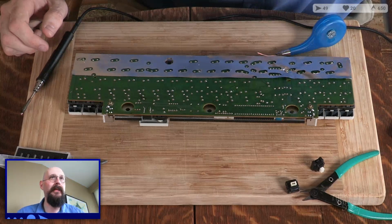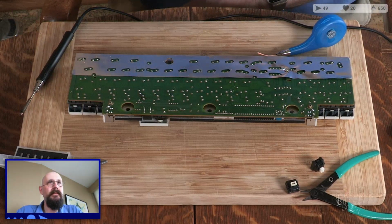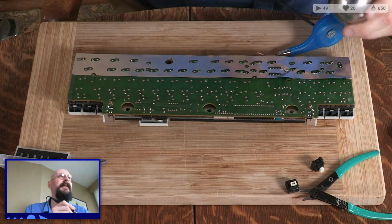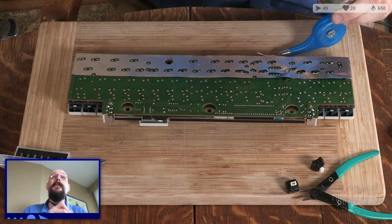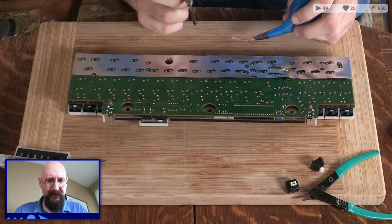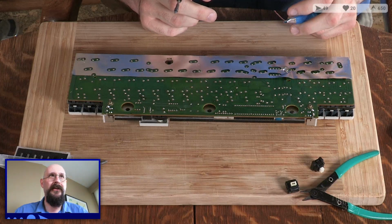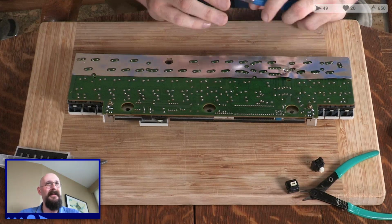Oh yeah, the discs in the 2Cs were great. What I really want is to track down an Image Writer 2. Style Writer was my first printer. It looked very good, but the Image Writer 2 is still useful to this day. Open, desolder, crack open switches, ultrasonic clean them in IPA. Lube the rails with Super Lube grease. Done. I think that's good.